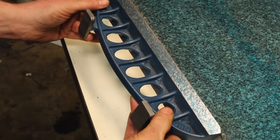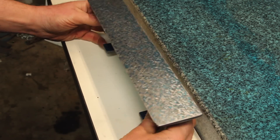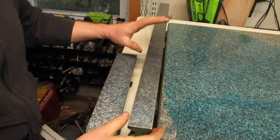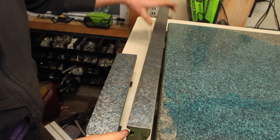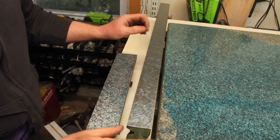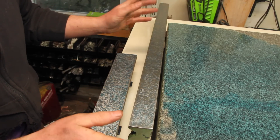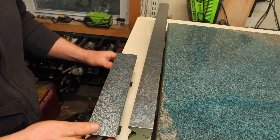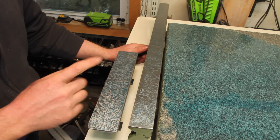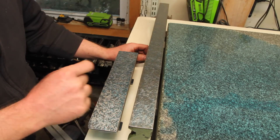I've been at that for a while — pretty happy with it. I think I'm gonna leave that there. Pretty simple little project. While I had the blue on the surface plate, I did a little tune-up on this longer straight edge I got used on eBay — just wanted to make sure it was nice and flat. Needed a little bit of work, but it's pretty good now. So those should be ready to use for rebuilding the mill. The next thing I need to do before I get into that is to make a square, so if you want to see that, stick around.